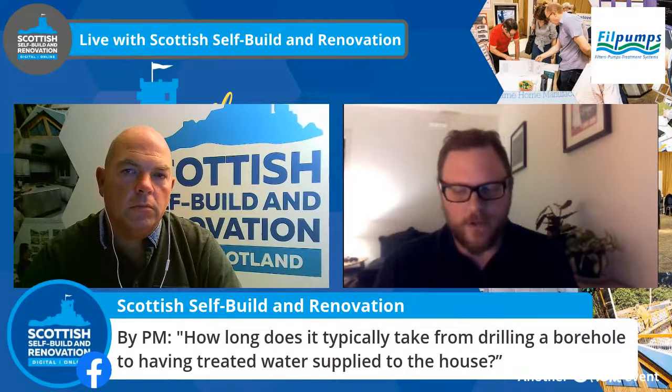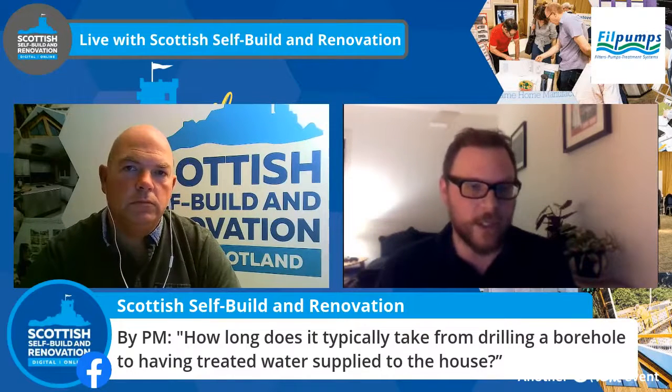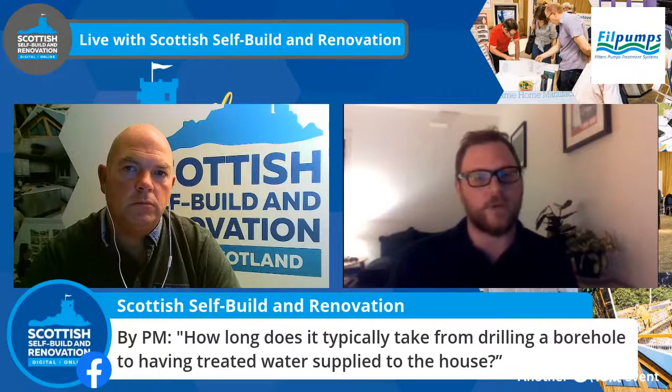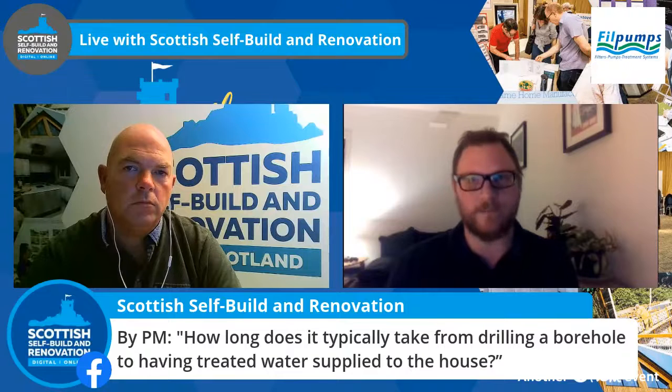Once the drilling operation has been finished, usually within about one to two weeks, allowing for engineer availability and pre-booked work, we'll have a service engineer back who'll perform a yield test on the borehole and take the water sample. The water sample goes straight to the laboratory, Aberdeen Scientific Laboratory Services in Aberdeen. They're a UKAS accredited laboratory, and we use the same one as the council.